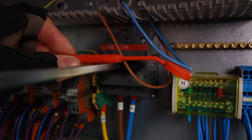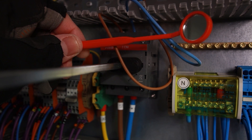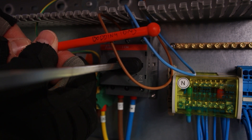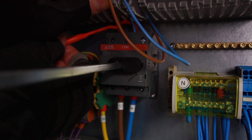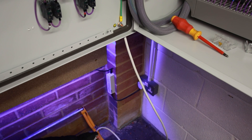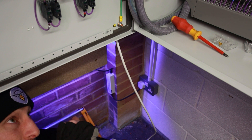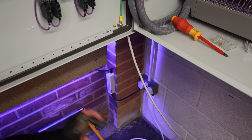And then the final thing before we switch on is to get our inspection tool — from Boddington's, official merch — and just check that we're not crimping down on the insulation. Both of those look okay. Then we want to plug it into the wall, having made sure our main isolator is in the off position, and switch that on — plug it in, switch it on.